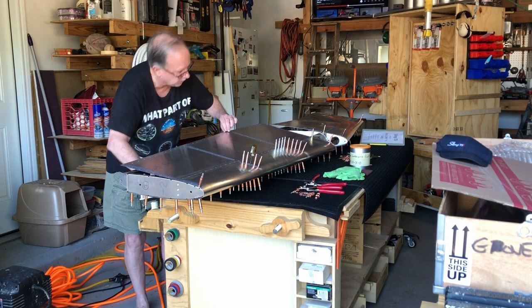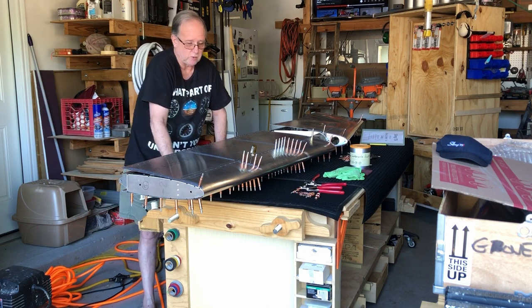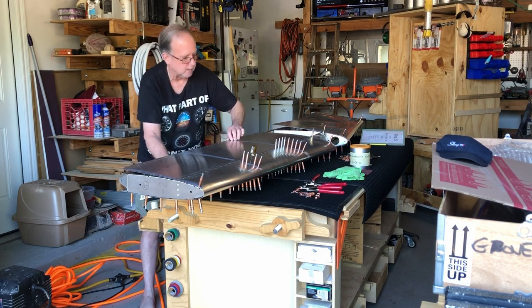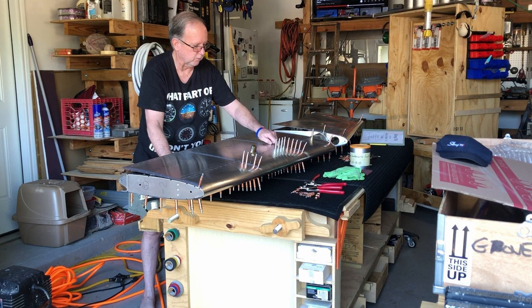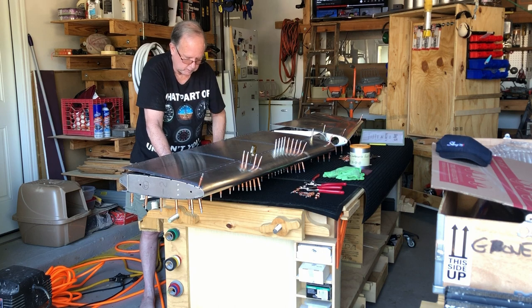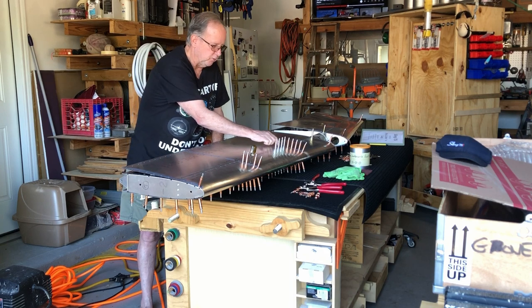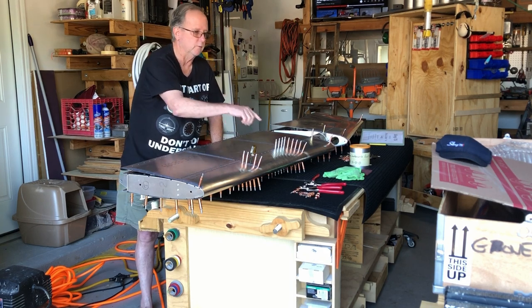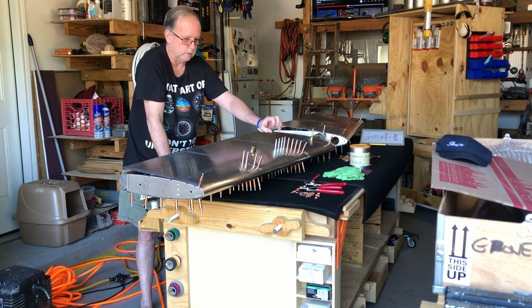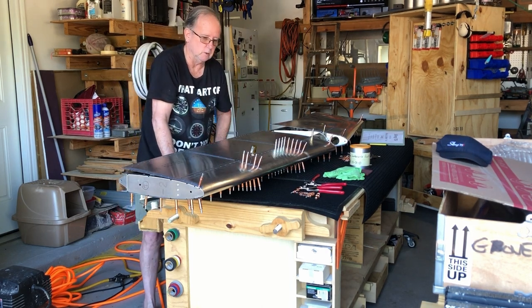And I've looked underneath here, I've got the camera set over where you're seeing it, not in my hand, so it's on a tripod. So I'm unable to lift this up and show you what I'm talking about. But when you're doing yours, you'll understand. There's an area where you countersink. You had to countersink these four, and there's 16 of them. So two on this side and two on that side. And then it became hard to get them to hold correctly when you're Clecoing. So that's what I found I had to do. So that's why I'm letting you know.